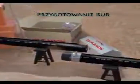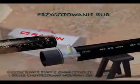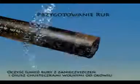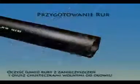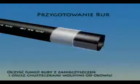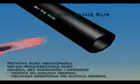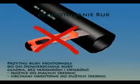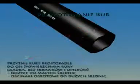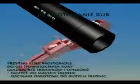Sand and mud shorten the lives of cutting blades and should therefore be avoided. The first thing to do is to clean the pipe with water in order to remove abrasives from the surface. Don't forget to dry the pipe with a lint-free cloth. The correct cutting tool will give you a clean, square cut that is essential for a good joint. We recommend the use of pipe shears for small diameters and rotational cutting tools for large diameters.